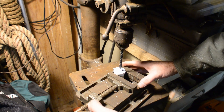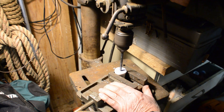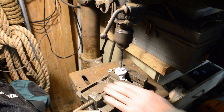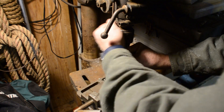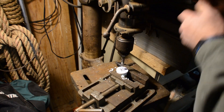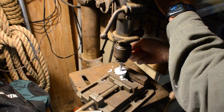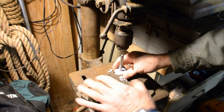When drilling plastic or PVC pipe with a standard drill bit, the bit's going to want to grab. So take your time, don't rush it, do it real slow and you won't have a problem. Now, what I like to do is keep that thread nice and straight going into that piece. So I'll put my 3/8-16 tap in the drill chuck, pull it down, and slowly start turning the tap until she starts. Then I'll stop, loosen up my chuck, take my tap and piece out, and go over and tap it by hand.